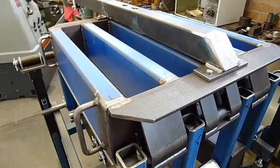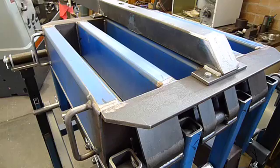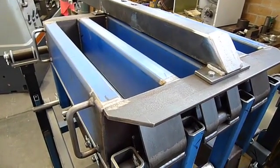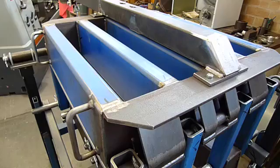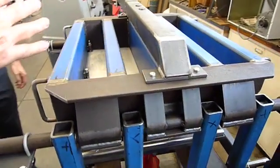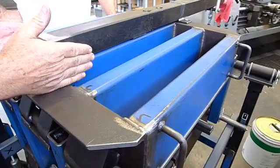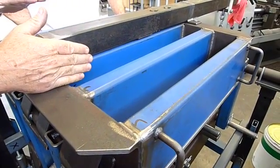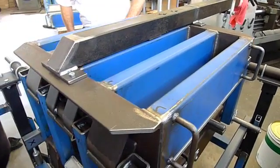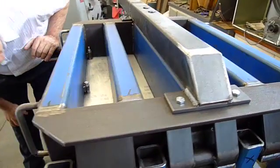These are instead of I-beams — they're square tube, generally known as RHS. But an extra one was added in. There were only two I-beams going across, and they were eight inches. The decision was made to put three in just to be sure — I'd rather be over-engineered.